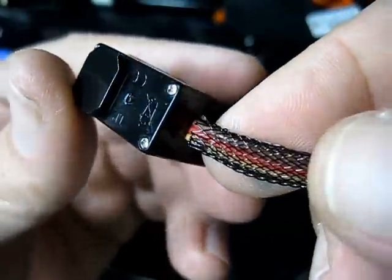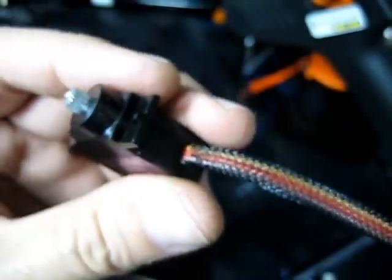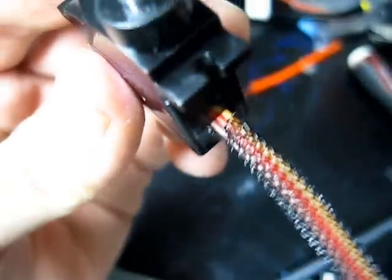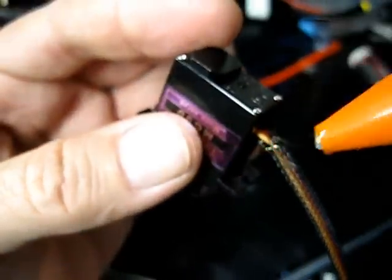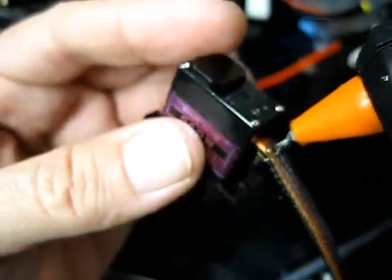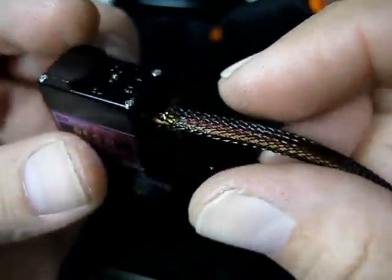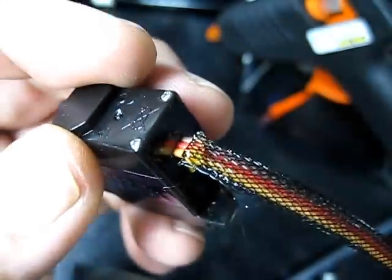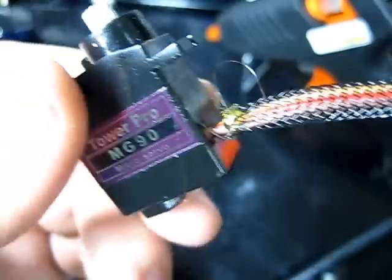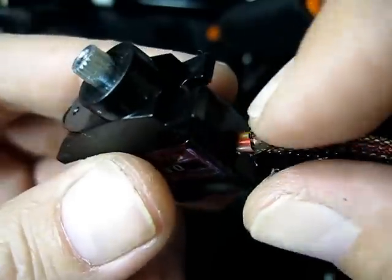So we've got this end sitting over the edge here. What I always do is put a little bit of glue on the end of that. That's all you need — just that tiny little bit. You might say that's not even on there properly, and that's true, it's not. But once you get the heat gun onto it, all that glue will melt underneath the insulation, all under the heat shrink, and it will fuse in there quite nicely.